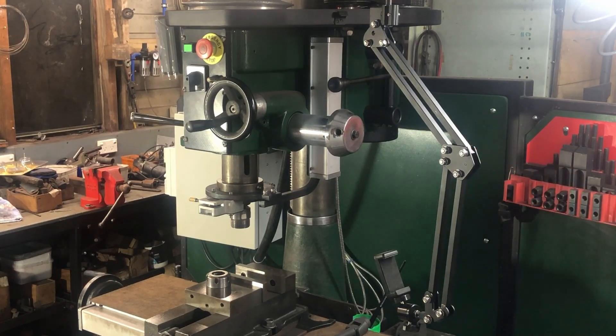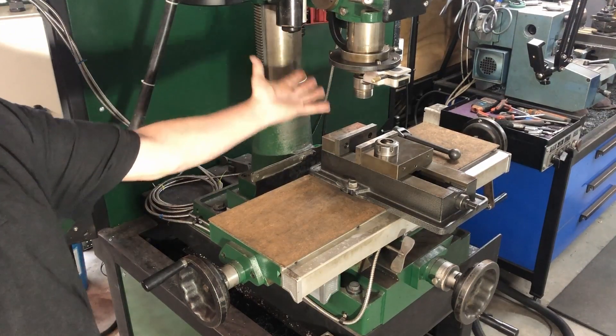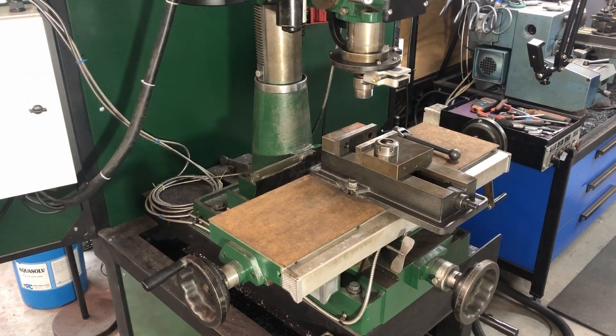As for next steps - as I mentioned I need to make some drawers for the front. At the moment my collets are on a different bench and I have to keep walking over there to get them, so that'll probably be another video on making the drawers. I want to add some lights that come down from in here or maybe from the side - I do have a portable one from the side but it's quite dark, so I need more lights. I also need to redesign that front panel and move the potentiometer away from the hand wheel so I don't keep knocking it and changing the speed.